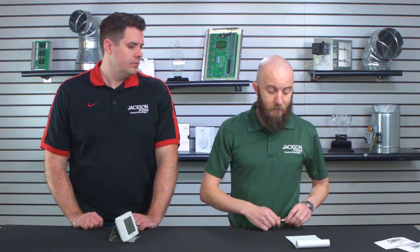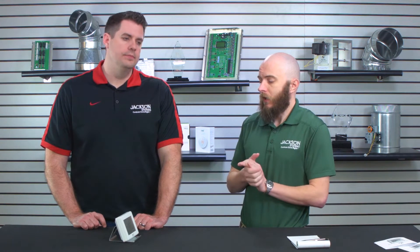You're going to make sure you have your times and temperatures laid out — probably write them down. We're doing a residential programmable, which is typically a four-schedule program. Your four schedules are typically referred to as wake, leave, return, and sleep. Wake is when you wake up in the morning; leave is when you leave the house to go to work; return is when you come home from work; and sleep is when you go to bed. For commercial, it's going to be a two-schedule — occupied during the day, unoccupied at night.